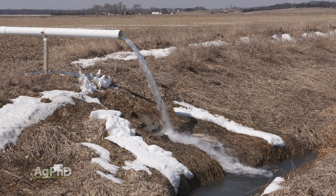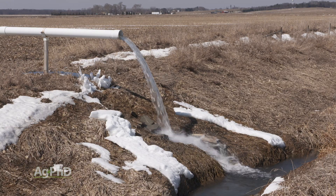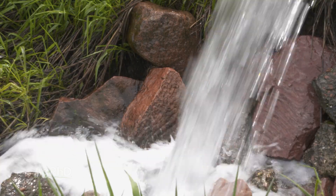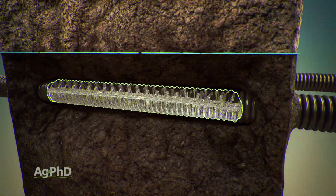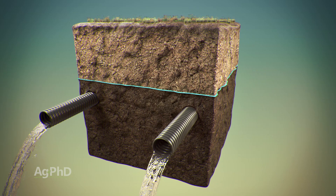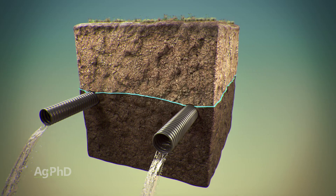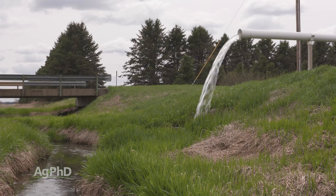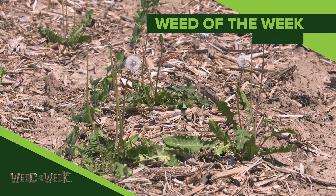You may be wondering: if they're pumping this water out, how clean is the water? Any time we're doing subsurface drainage tile pipes — just like the pipes around your house — the water has to go down through the soil, which is a natural filter, and the water coming out is often drinking water quality. The only problem with great drainage is that yes, it will help your crop, but it will also unfortunately help you produce more weeds, like our Weed of the Week will tell you how to stop on your farm coming up later in the show.